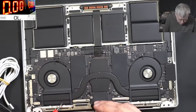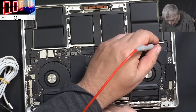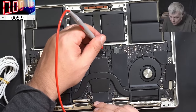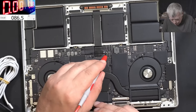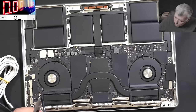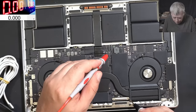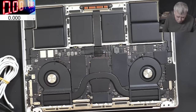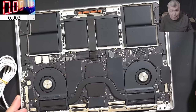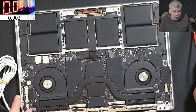Six ohms on the capacitors. Six ohms, six ohms — checking the capacitors and getting 6 ohms. Checking for voltage on the shift rail — I know the battery is plugged in, but I really doubt we have any voltage. No, we have nothing. Let me pull out a schematic and have a look, because 6 ohms doesn't look good on a power rail.